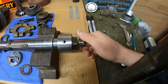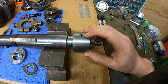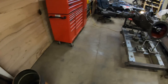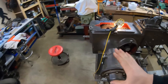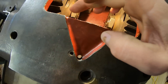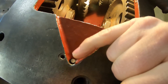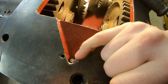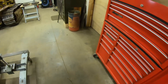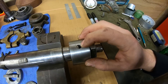But just for temporary mock-up, we can run that nut up there. So that is what locates the rear of this live power shaft. And our oil inlet hole has to face up. But it is also going to handle all of the end thrust on this shaft. Way back when I first started putting all the parts in this back end — that's that hole; it's got this catch trough that feeds it. Let oil run down into those double bearings. I threaded that so that I can turn a hollow stud, or peg if you will, that will thread down in that hole.